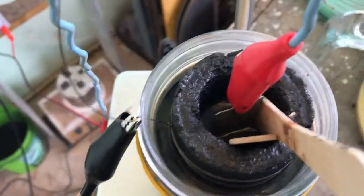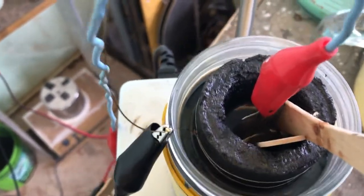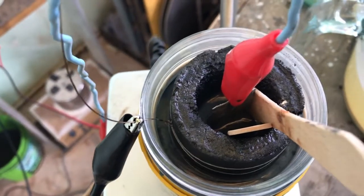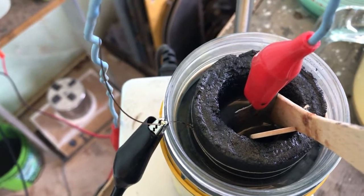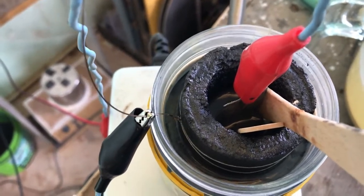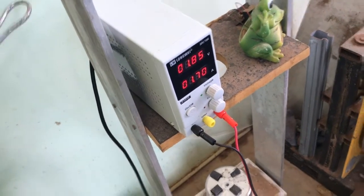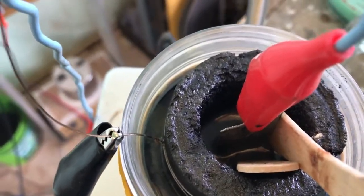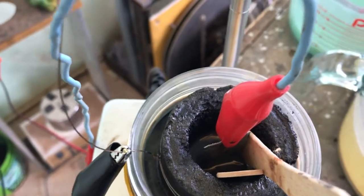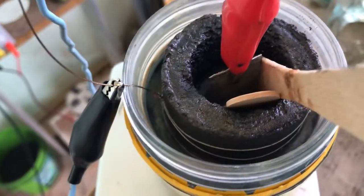Okay, I'm starting to electroplate the inside of the cell. It's just vinegar. I'll put 1 gram of zinc sulfate in the vinegar as well as salt, and a little bit of zinc plate beforehand. And then I thought I might as well just stick the zinc in there. I had to turn it down. It was on 1.6 and it was 3 amps pumping through that cell. So it's really good. It smells very sulfury, so maybe there's some sulfur content in those things. It's very porous. I was watching bubbles come up through the carbon wall.